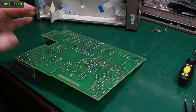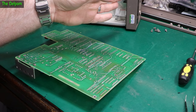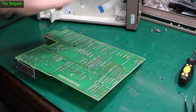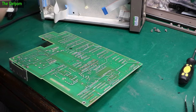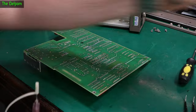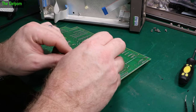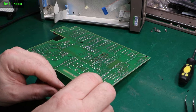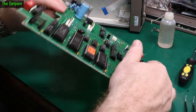We've got some bodges on the back here — some re-soldering work and some bodge wires, which look like factory originals potentially. There's flux left on the board here and over here — either that's repairs or something done later on. Makes me think it's repairs because it's the only bits left on there. Maybe I'll give those a clean up — I just don't like to see those left with flux on. Something I forgot to mention: when we pulled the front panel apart, the display had a date on there of 1988 on the back of the panel.